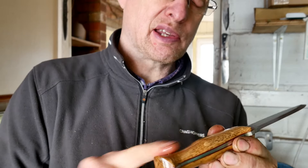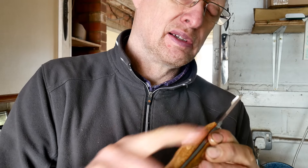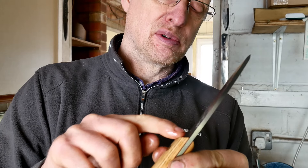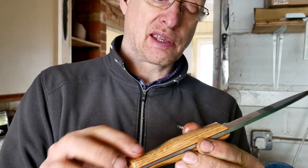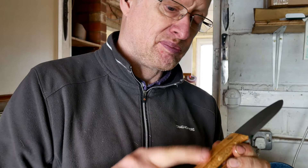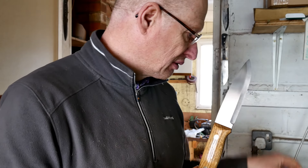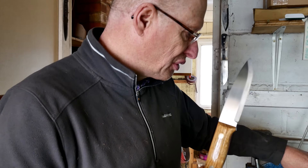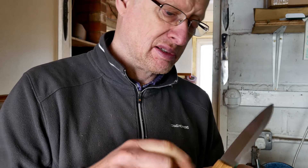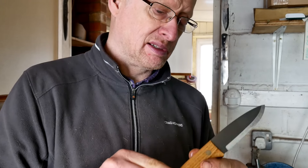You could put it down like that for an hour or two, then come back and wipe the oil off. The oil could become a little tacky as it starts to harden. Generally I find that the linseed oil won't harden that rapidly — it takes sort of a day or two for it to start to polymerise. Again, circumstances like temperature and humidity will affect the speed of that process.